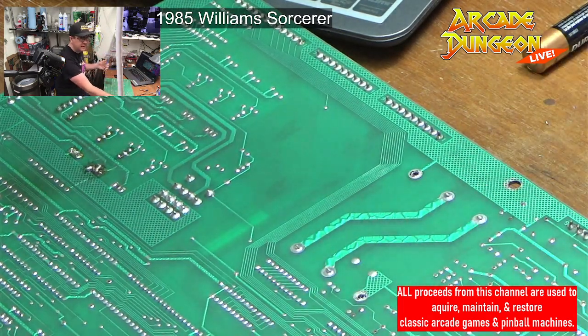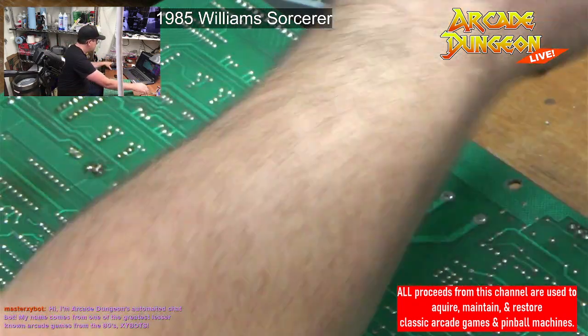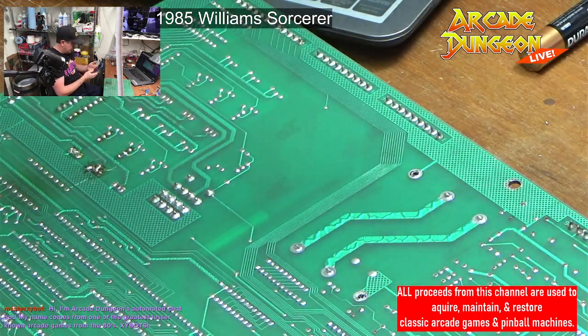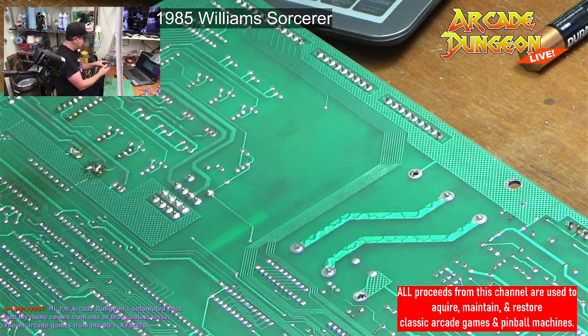I'm going to verify with the intranet, because I want to make sure I got the right ones. Intranet. Come here, you. There we go. System 9. On the system 9, solder the black cables, ground black wire to the bottom left pad, and the positive to the top right pad.